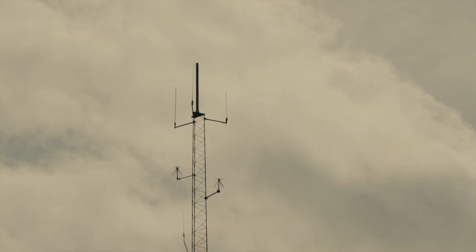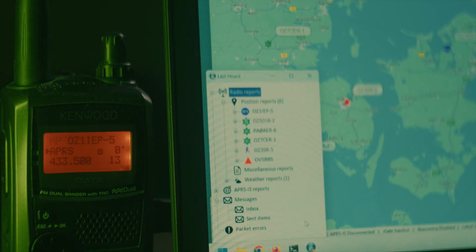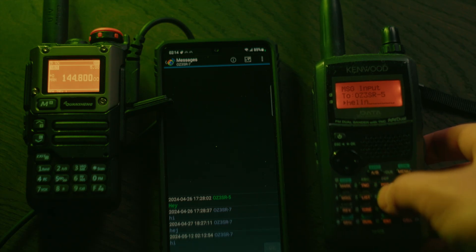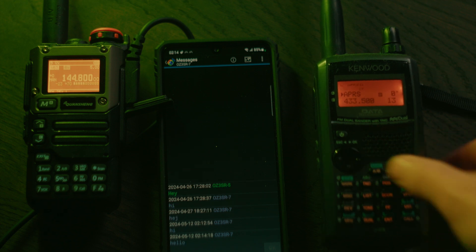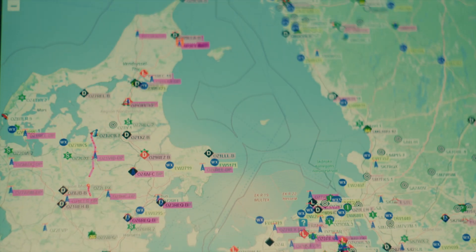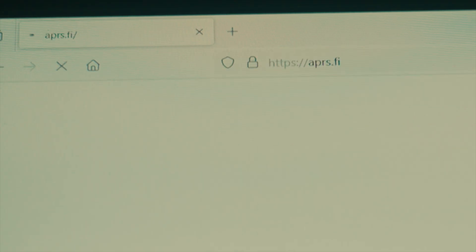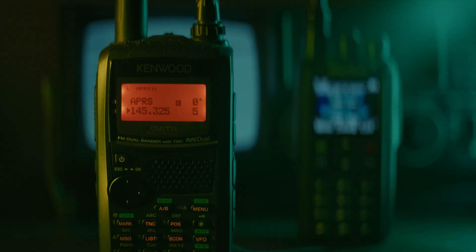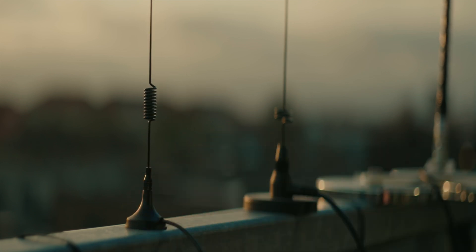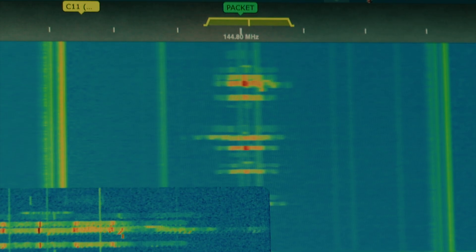There are also quite a few radios with APRS built in, or ways to connect your radios to computers or smartphones to use APRS software. Just like Meshtastic, your APRS device can beacon your location or send text messages to other devices through the network. Some digipeaters are even connected to the internet, linking the network worldwide, allowing for integration of automatic services and making it available on websites such as APRS.fi. APRS is used on amateur radio frequencies at much higher power output and better frequencies for long-range communication than Meshtastic, but APRS also requires a license and a call sign.